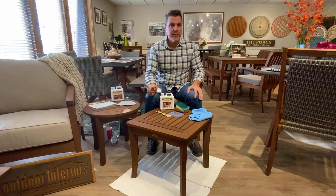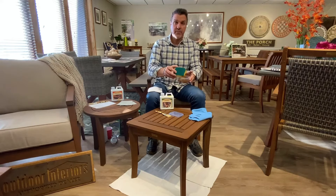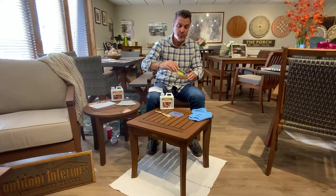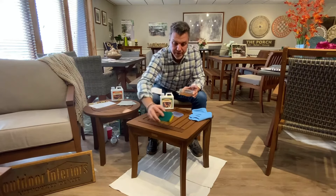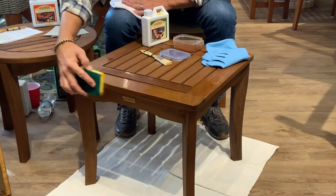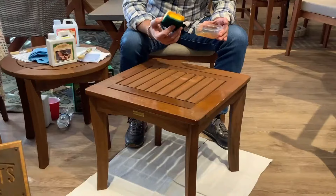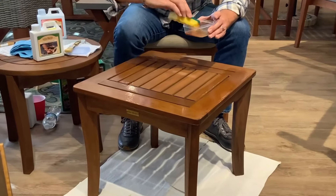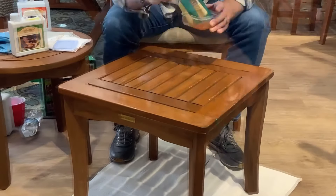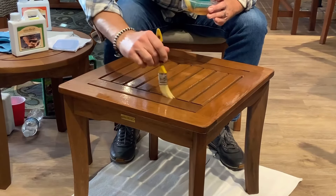For the next step, you're going to see everything that you need for oiling your furniture. We're going to start by filling our reservoir or container that can be reused with this sponge application. This is a great way to apply the hardwood oil to your furniture — it goes on easily. Always oil with the grain. You can come off to the side, but this is a great way to start your oiling project. For furniture that has crevices or areas that are hard to reach, you can also use the brush that's been included.